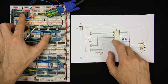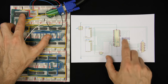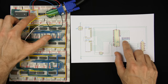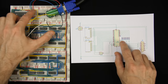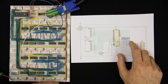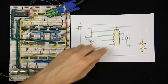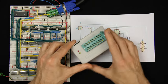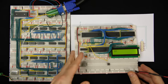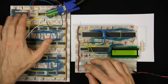Putting all those binary bits together gives a 14-bit binary value that forms the address for the ROM. Whatever is programmed in the ROM at that particular 14-bit address spits out some 8-bit value. We look at six bits of it and run it through these resistor divider things that generate four different voltages per color, which gives us 64 different colors — red, green, and blue. That's basically what pixel you get based on what address you put in, programmed ahead of time.